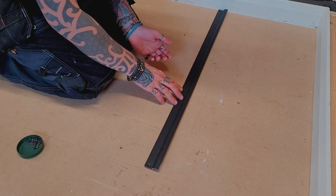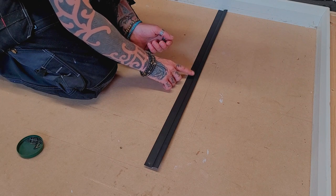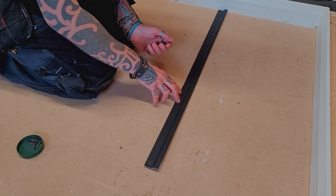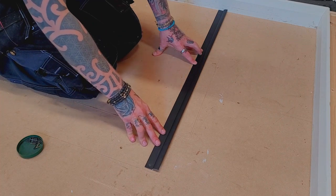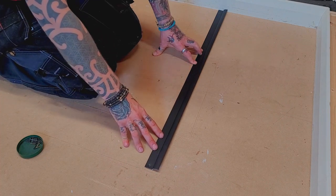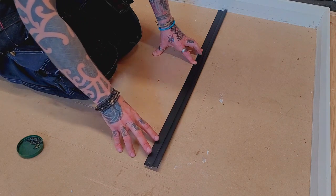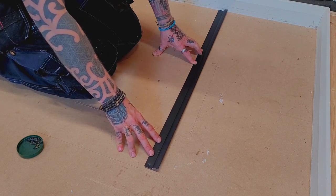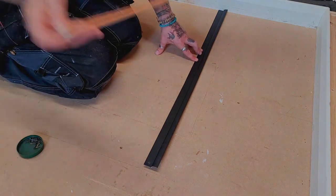When we're installing the Zee Bar onto a timber substrate, we need to mechanically fix. So I'll use the gripper to pin through into the subfloor itself. In regards to the positioning of it, if you're working up against open spindles or beading or any fixed object, make sure you leave the appropriate gap as recommended by the relevant standards. So I'll get that into position.